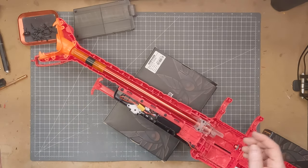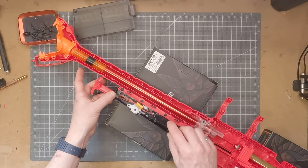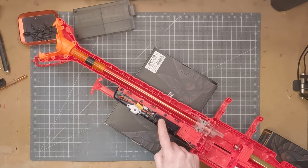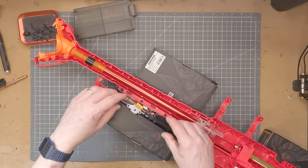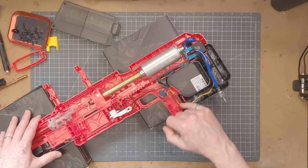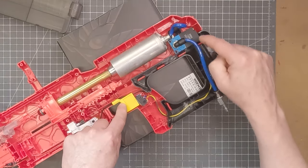The last thing then was powering the solenoid. I decided to store this little lipo up the front here - it's a 3S lipo, giving me about 12 volts to run the solenoid, and it fits quite neatly in the front. The main reason I chose to store the battery up here is so I can more easily remove this front piece to access the battery and give it a charge without having to disassemble the whole blaster. It has a regular XT30 connector. The wires run underneath here through drilled holes, underneath the mag well, underneath the magazine release piece, and through to the trigger. The trigger is mounted on a bed of 3D filament using one of those pen devices, and a couple of screws hold the switch in place. So now the trigger will activate this switch - pulling the trigger closes a circuit and energizes the solenoid to switch position.